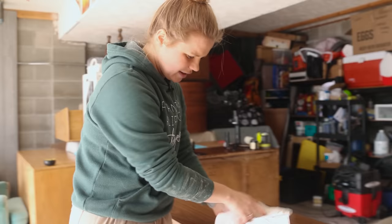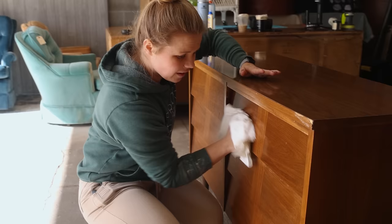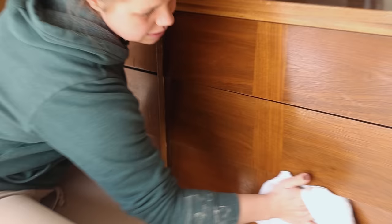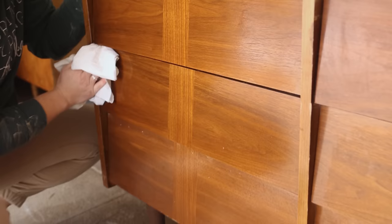This is why we want to clean our piece — because it is dirty. If it's dirty, that paint will get all clogged up and it won't adhere very well to the surface, which then will cause a bad finish and the paint could scrape off very soon after you paint it. So I just want to avoid that at all costs. Plus, you don't really know where the pieces have been, so it's just important to give it a nice wipe down with any degreasing cleaner.